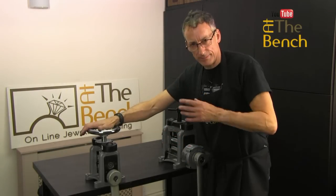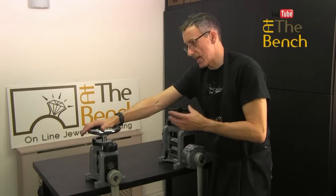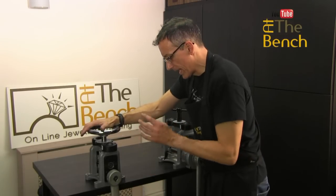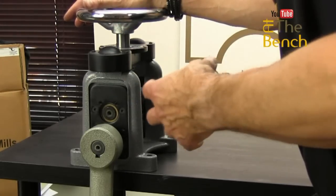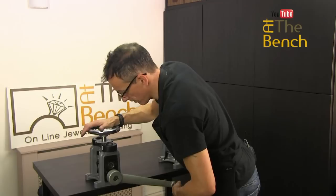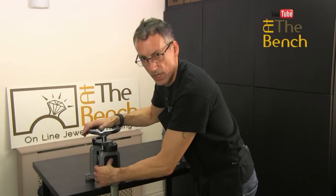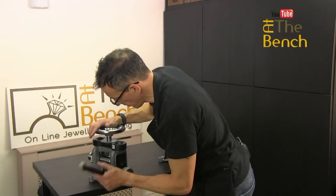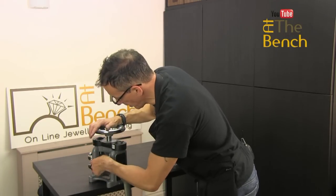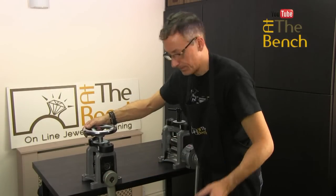So that is a direct drive — for every one revolution of this handle, it turns the bottom roller once. This is quite an inexpensive rolling mill because, obviously, due to the engineering part of it, it's still a fantastic rolling mill. Now, you're going to work that little bit harder when it comes to rolling down, because it is a harder job trying to roll down your metal with a direct drive. The handle directly turns that bottom roller, and the linkage, cogs, and teeth within it then turn the top roller in the opposite direction, which means you can roll down your metal.